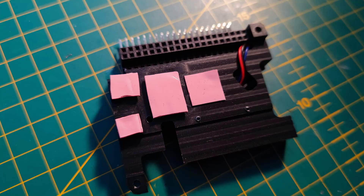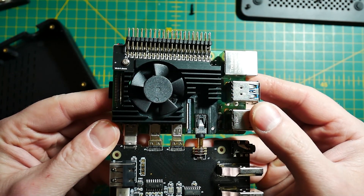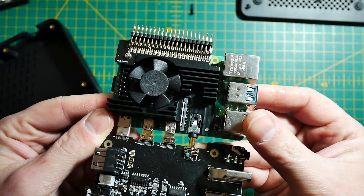What's interesting about the heatsink is that it uses three extra connection points. Don't be like me — I initially forgot to include the heat pad for the CPU because the visual indicators only show three different heat exchange points: RAM, Ethernet, and USB ICs. So make sure you put all four heat pads on there to complete the heat transfer between the board and the heatsink. The fan design has also changed and is slightly different to what you'd expect on other cases.